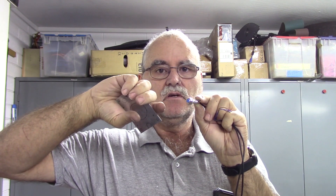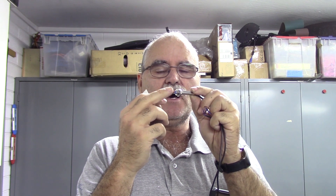In this chapter of the Emco PC5 upgrade, while I'm waiting on parts, I'm going to install Hall effect sensors on the motor mount plates. The idea is these Hall effect sensors detect magnets, so I'm going to embed a magnet in the ball screw pulley on both the X and Z axis. I'll clock the pulley toward the end of its travels so there's about a quarter turn, plus or minus. When the Centroid CNC software homes the machine, the pulley will turn, and when that magnet passes in front of the Hall effect sensor it will trip and let the control know to set home at that position. It's a pretty accurate way of setting home.